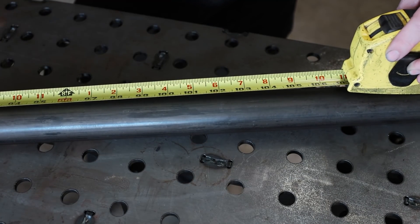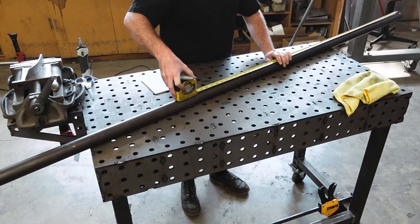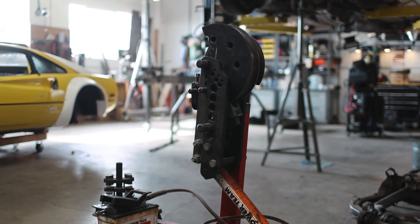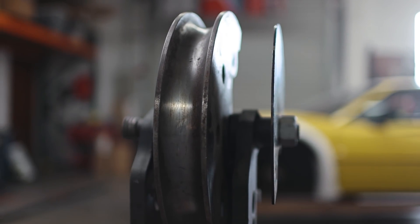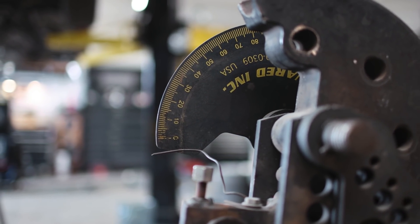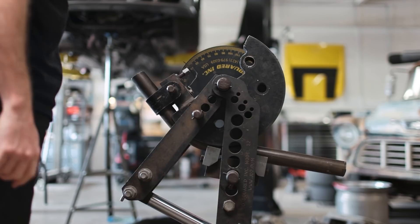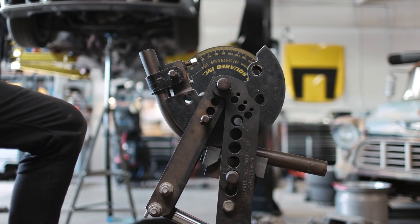We know we need 102 inches of tubing in overall length, so that'll be where we cut it. The only other dimensions we need to transfer to the tube are our center line at 51 inches, nine inches to each side of that, and then 16 and a half inches from those lines to the end. Then we get to put it in the tubing bender — one of the coolest pieces of equipment I have in the shop. It works by putting a piece of tubing between two dies and using air-over-hydraulic pressure with an arm to bend the tubing around the larger die. It's got an indicator on the side so you can tell how far you've made your bend. If you're enjoying this content, do me the favor of leaving a like and subscribe if you want to follow along with this build.